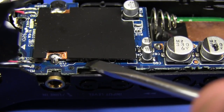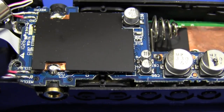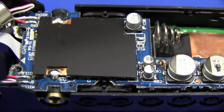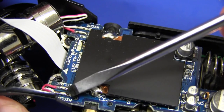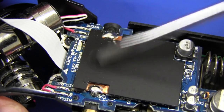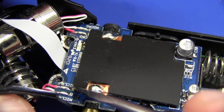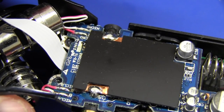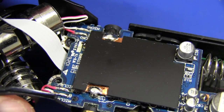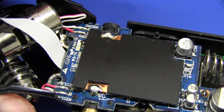Let's lift up that skirt and see if we can find anything under there. We may actually have to desolder the shield. And of course you can see the microphone connections there as well - that's why it needs all the shielding. I can't seem to get that plastic off - it seems to be well and truly adhesive stuck to the copper board. So it looks like we are going to have to desolder that. Bummer.